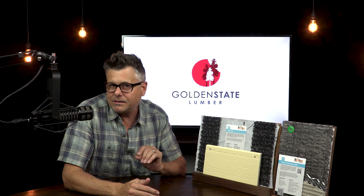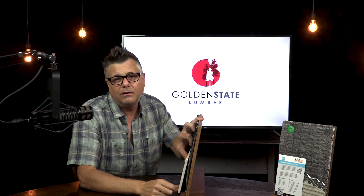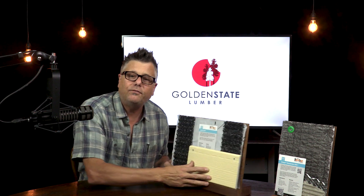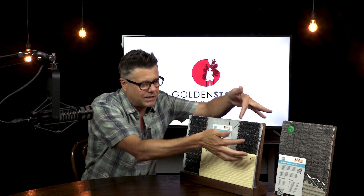But there's another benefit here I'd like to discuss. This product, as can be said with just about any RainScreen assembly, also acts as a thermal brake, isolating the exterior siding from the exterior sheathing, reducing thermal conductivity between the siding and the wall, defending against heat transfer. Because the siding is going to get hot, right? But the sheathing behind it won't, because it's not in contact — it's suspended between the Keen fiber.